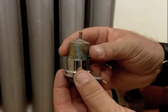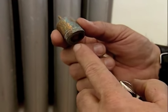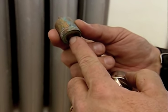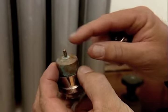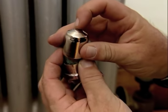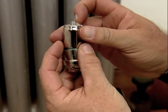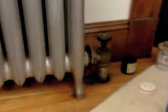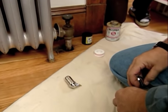What's inside is this — a brass bellows, filled with alcohol and water. When steam hits it, it will expand, and as it does, it will drive this needle right up against the top to shut off the air coming out. Shuts it off tight. It sounds like yours is all gunked up inside there, and it certainly doesn't owe you anything — it's probably 30, 40 years old.